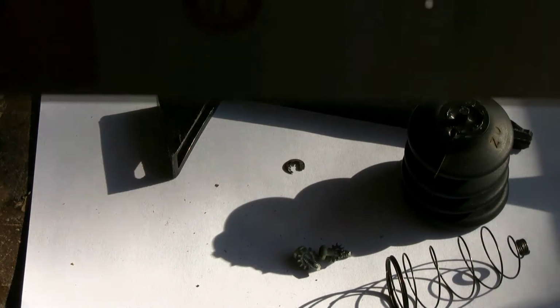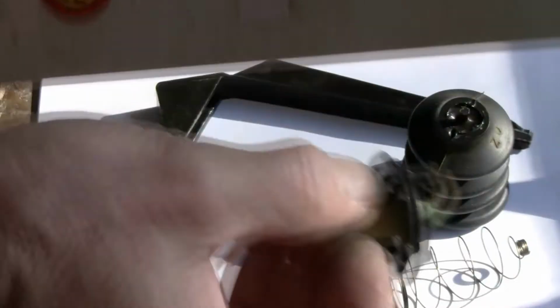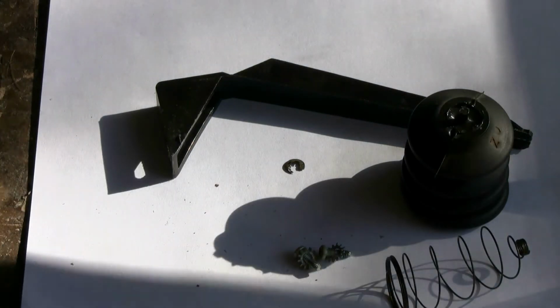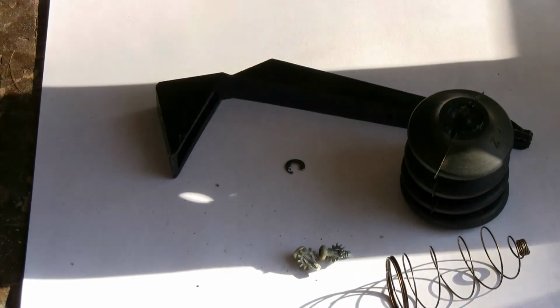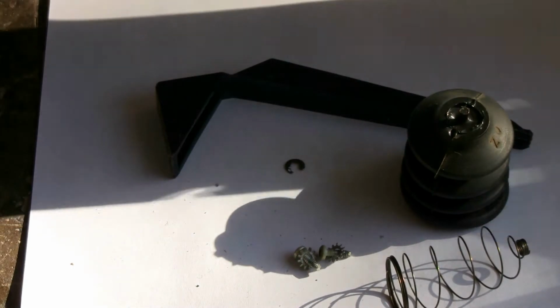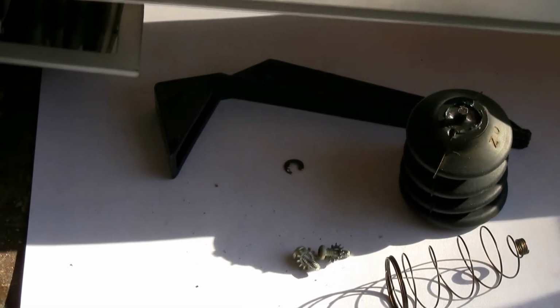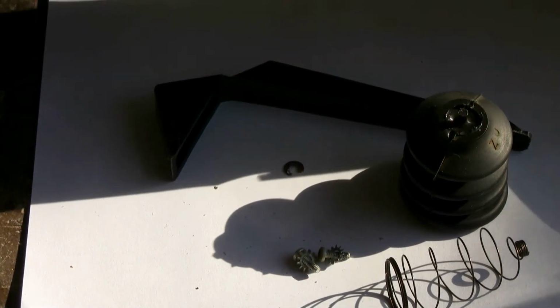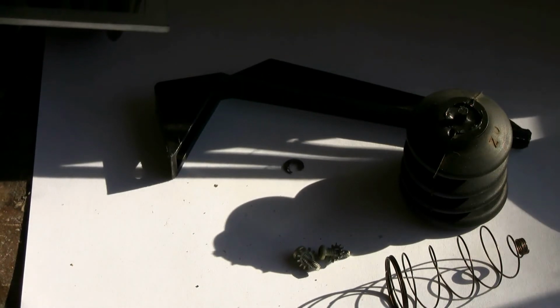This is the other side of what it looks like. You can see where the mounting bracket went, and where this piece went, like this. And the reason that I don't think that Kimball ever figured that anybody would ever take these out is because there's another piece of aluminum that goes in here that's actually press fit into here, and you actually have to bend this piece right out. They got these little slots right here and right here, that you can put a screwdriver in to bend this piece away so that you can remove the bottom plate, because underneath here are all of the tubes that connect in the bottom half of the piano to all of the valves.